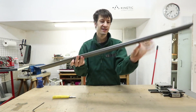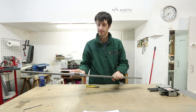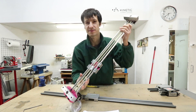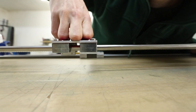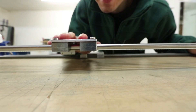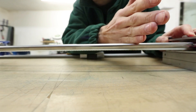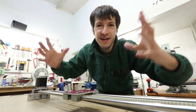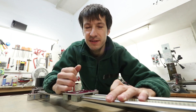So this is the main rail and this is the slider that fits in this rail. This is the first slider I built — it's like the traditional way of making something like this, with two axes and the four linear friction bearings. But that has a problem: it flexes more in the center than on the ends, so the movement will be drawing an arc. Anyway, it only happens when you mount a big heavy camera.